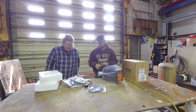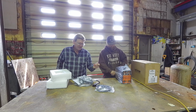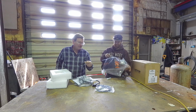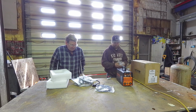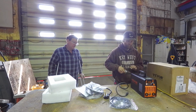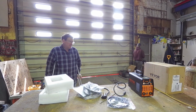Yeah, they gave us some rod. One rod, 3/32. I'm guessing, it doesn't really say. It's a writing that I'm not familiar with, maybe European or Japanese or something. It's a J422. I think it's 7014 or 6014 is my guess. I'll bet you it will run better as far as starting than most of the rod that we normally run on them. But those don't usually run as smooth, so I like running the other rod. I like running the 18 series.